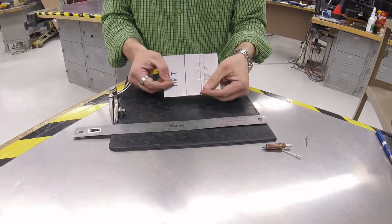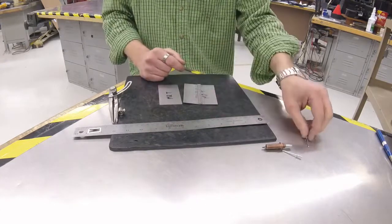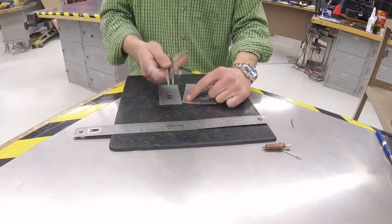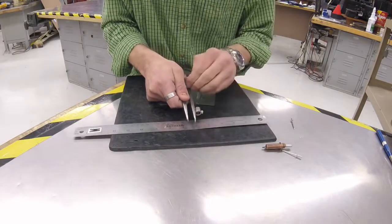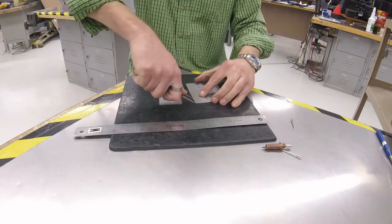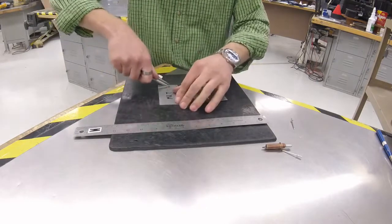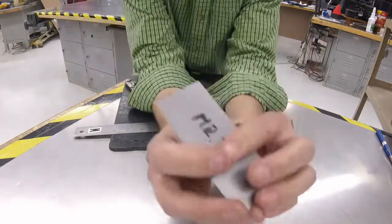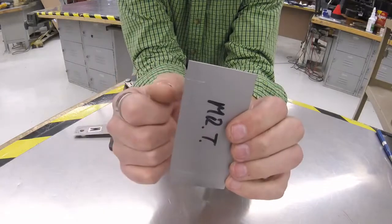Those lines are going to go this way. We need to locate on that line where we need to punch the holes for the pop rivet. I'm going to put them a half inch in from the edge. Set the dividers to half an inch, move them out, tighten them up, double-check. Now I'm going across my line on both pieces. What we're looking for is where those two lines cross — that's where we're going to punch the hole.